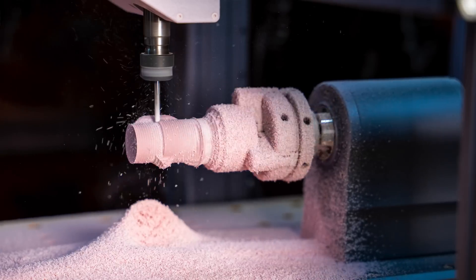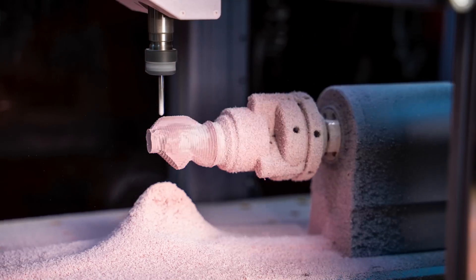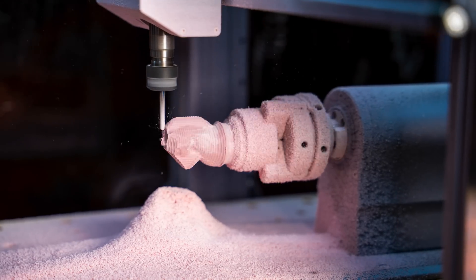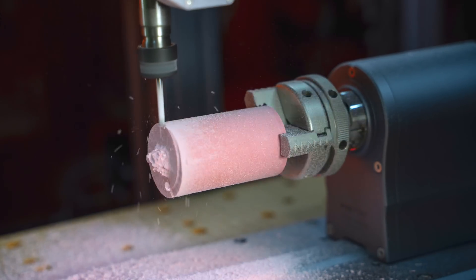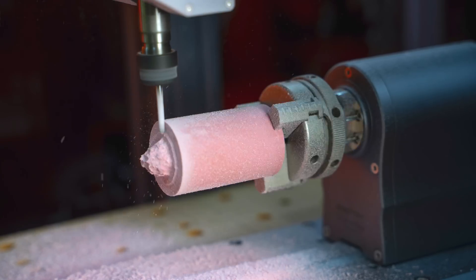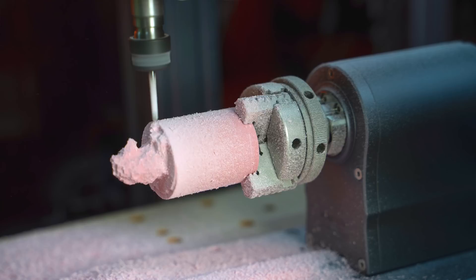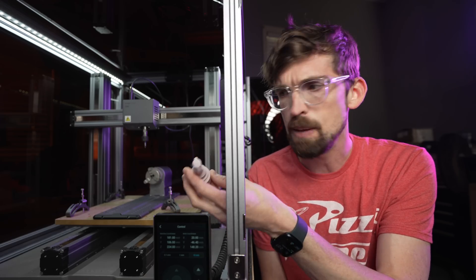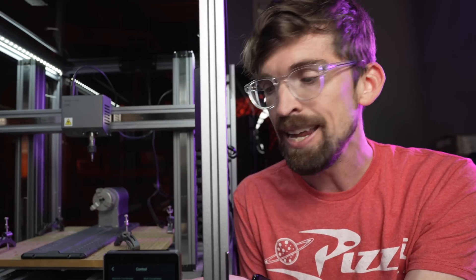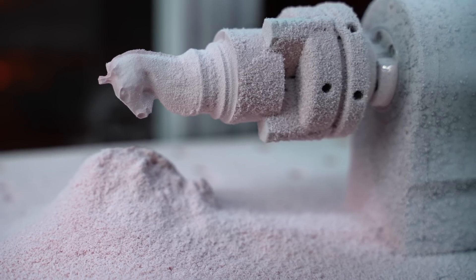In the future I'm going to use Fusion 360 for a lot of the rotary work because it gives you much more control for carving versus Lubin, which is very basic. Fusion is really going to let you dial it in and tune it to your machine. One big reason is that Lubin doesn't give you an easy option for two-stage carving with the rotary — you'll want to do a roughing pass and then finish with a thinner bit. With just the V-bit, I got an estimated time of 96 hours for the horse head, which is insane. But throw in a roughing pass that takes about an hour, and it can finish up in a couple more hours, so times go way, way down.